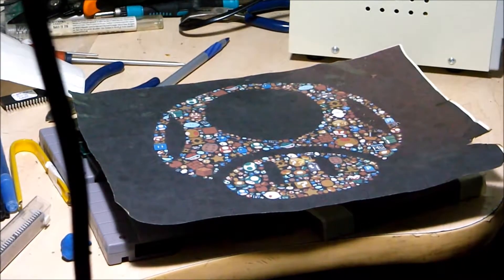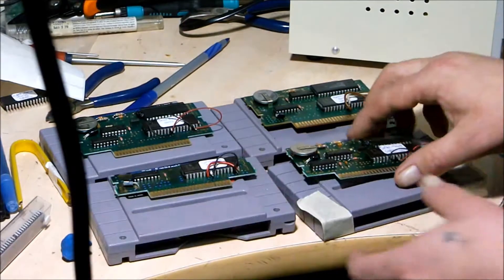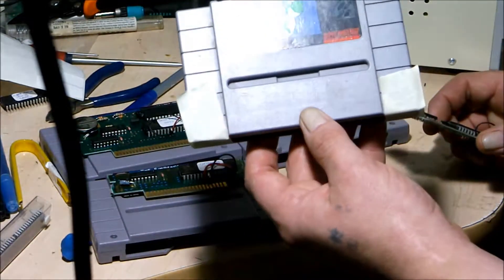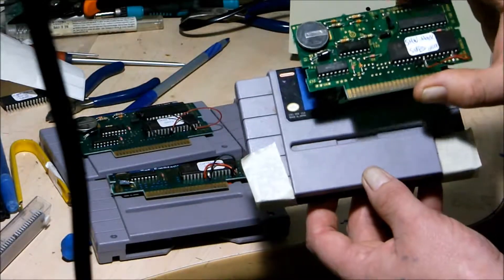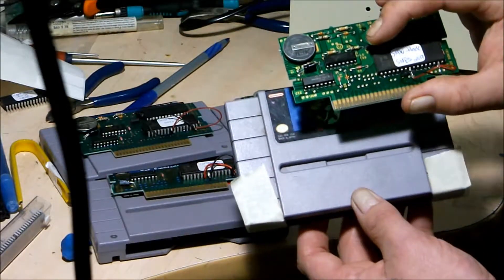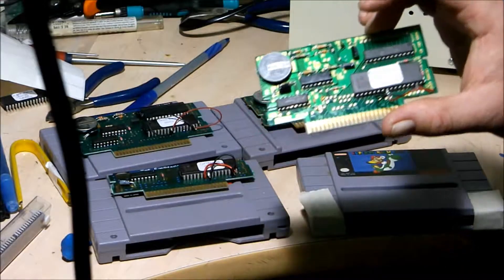After a lot of trial and error, I wasn't able to put a Super Mario hack onto the PCB, because as soon as I added files the chip needed to be bigger, and all I have are these M27C801 chips. So this didn't work.